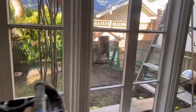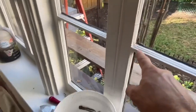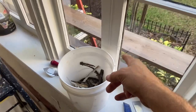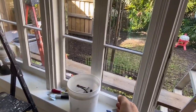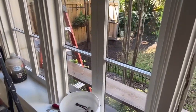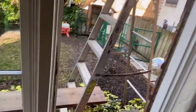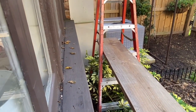I could see immediately that this one has problems. There's a section of the sash that has been replaced. If this sash is going to function and operate, that's not going to fly — I'm pretty sure it was just cut out from another piece and put back in. So when I take this section out, it's probably not going to be salvageable. I took this section out knowing there weren't any hinges attached from the outside, and you start to see other things — like this sill here that was added on. You can tell because down there you can see how it's not connected all the way.